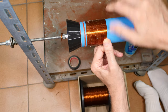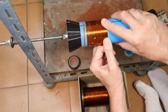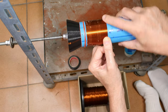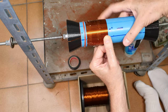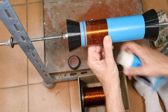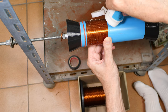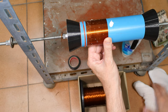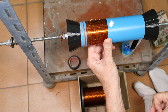So in order to make it straight and lay down, and of course a thinner wire requires a whole lot less pressure. So this is 19 gauge, and if you went with like a 22 gauge, it would make quite a difference. It'll also change the number of turns. I got a video on how to calculate the number of turns given certain parameters, and that'll make life easier. But yeah, I kind of like to use this 19 gauge. I've grown accustomed to it.